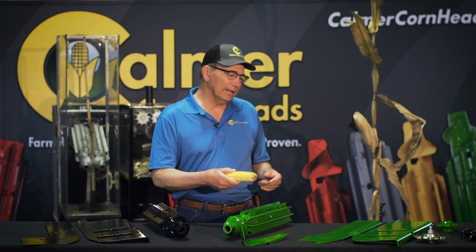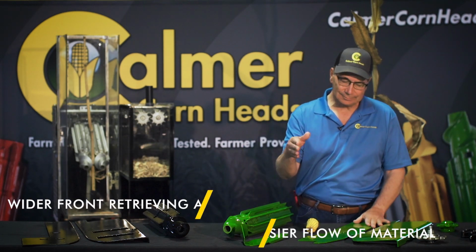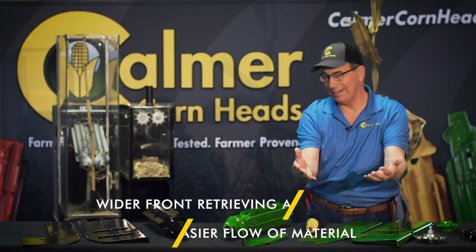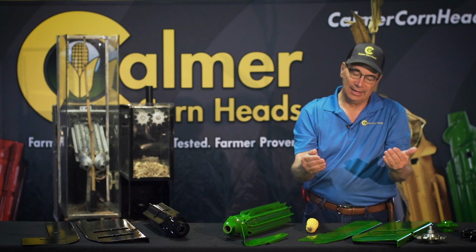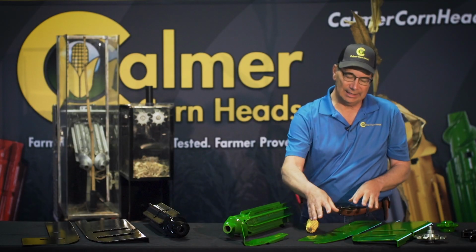So we developed what we now call the combo stripper plate. It has a little wider V up here at the front. So if I'm in down corn, it does a little better retrieving, or if I've got twin row corn, or when I'm dumping on the go and I need a little wiggle room out there, this gives me a little more freedom in the row unit.